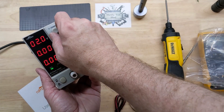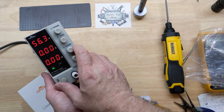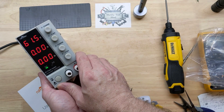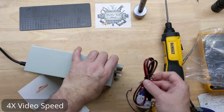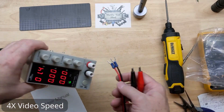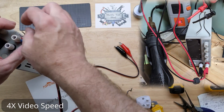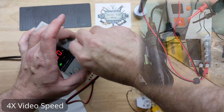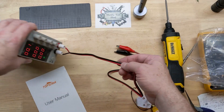So with no load we do go down, and of course the coarse gets us up to 56 volts and the fine takes us all the way to 61.5 — so that's great. I actually like the way they sent the alligator clips because clips are fine a lot of times, and I have my plug-in banana plugs that I can plug in if I want something different. These can stay attached at all times, so that's pretty cool.